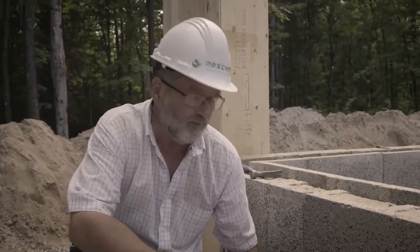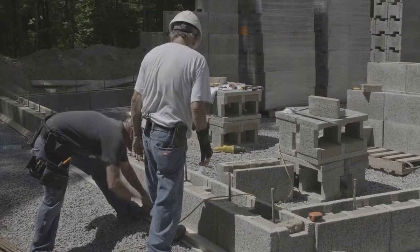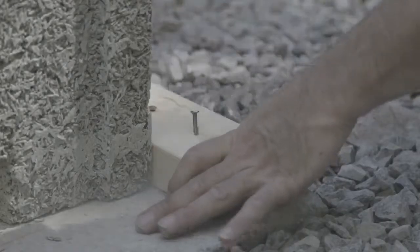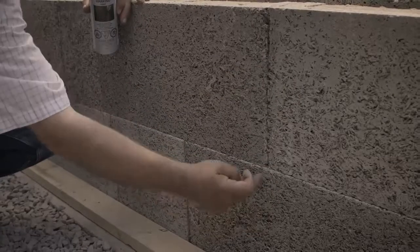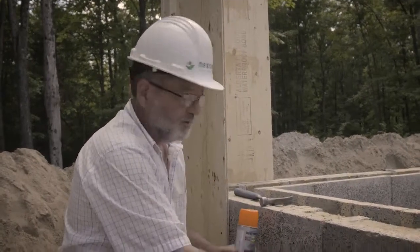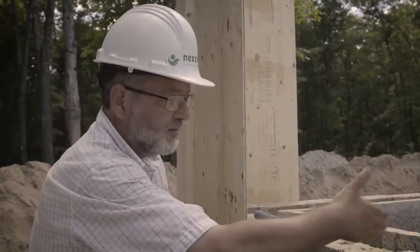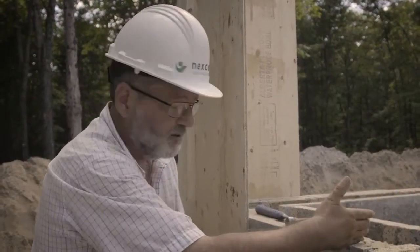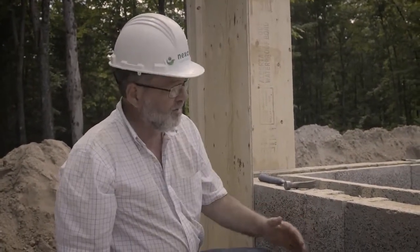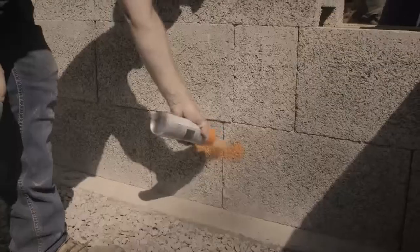To help keep our corners in place, we've nailed some 2x4s on. They're just so that as we're moving block and banging the wall around, it's going to keep our corners in place and keep our wall straight. You can see where we've split it over the center — that's just to help keep blocks level with one another. As we've come across, we've got to the spot where we've chosen to make cuts, and our bond will change. We've maintained our cavities and lots of concrete in our spots — nothing's jamming us up. So when we've made that cut and we're ready to move on, we'll just hit it with some spray paint and it tells us where we're at — just a mark to tell us we have to remember that.